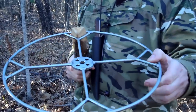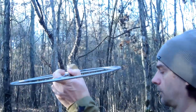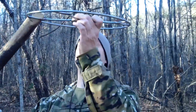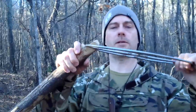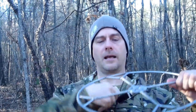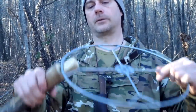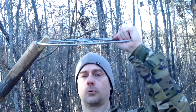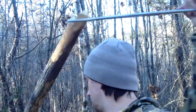Now that doesn't even need any carving, because what it does is when you put it together, this is going to lean up at an angle like this. And when you get it all put together, it's not going to twist, because you've got a flat holding it, keeping the logs from twisting. Because sometimes when you put one together, I used to make it with holes and it would twist. And then that's when I came upon the idea of cutting the flat and the triangle, and it actually holds and it won't twist. So let's see if the others fit pretty good.